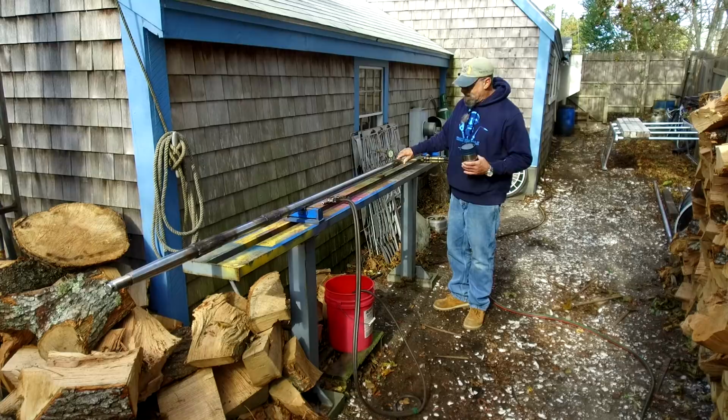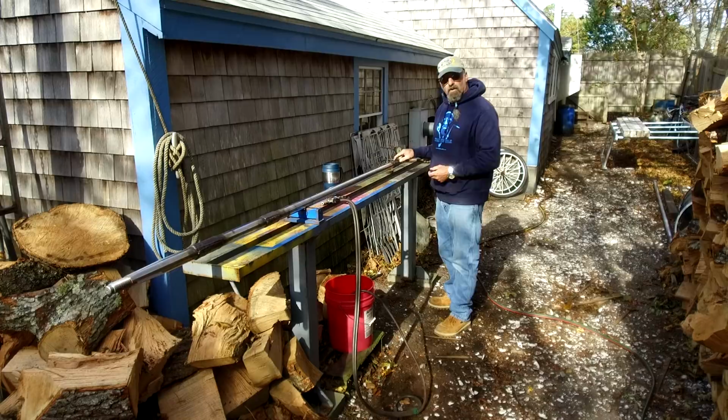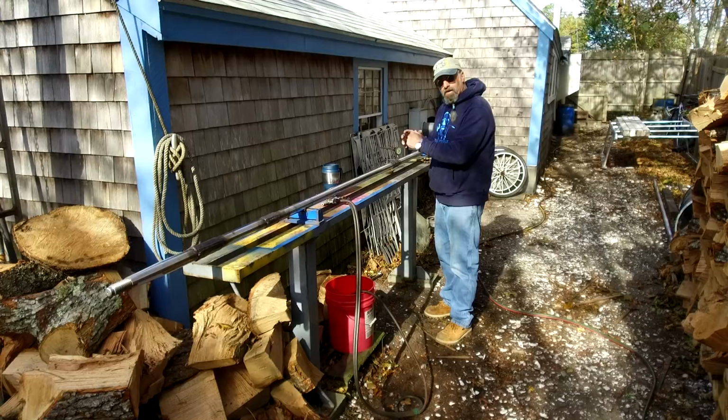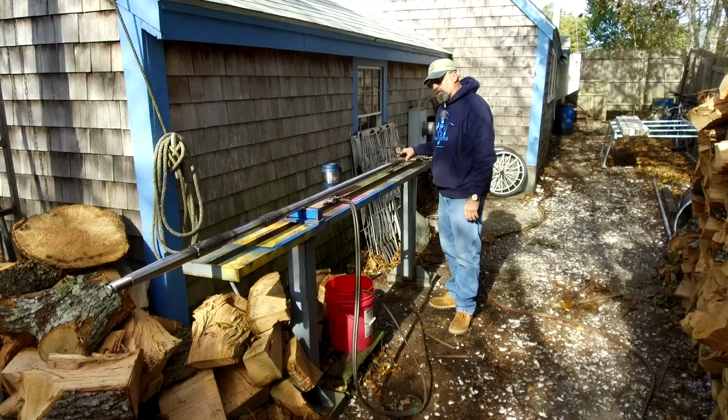80 thousandths on this side here, and I'm reading about 85 thousandths. In reality, instead of doing a heat spot on each side of here, I could go ahead and rotate this around and then put a weld bead on the side that I want to draw tighter and get my contraction that way and create the straightening. But we're not off that far, okay? I can draw 40 thousandths out of this in a short period of time, and that's what I'm going to do. So I'm going to draw that out as close as I can get it here.